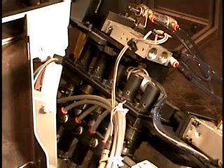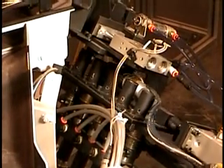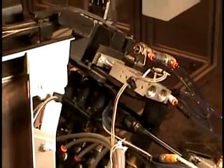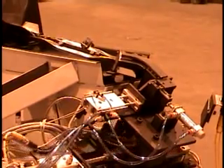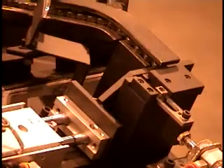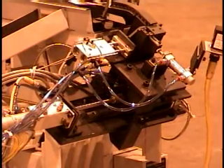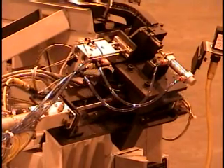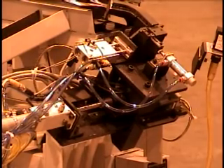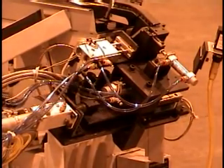Multiple presentation of bolts is easily done in 1.8 seconds per cycle, where parts are gently metered to optional orient or tooling. Here, bolts are coaxed to hang by their heads, escaped into five shuttle nests, and released to flex chutes.